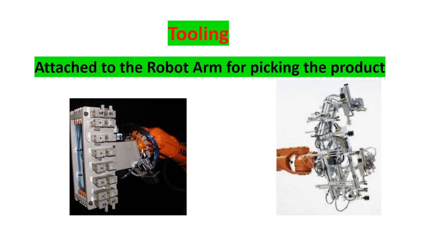Reminder: if your robot has tooling, you need to drop it in a rack or cart, because sometimes your robot is located in a tight space, and once you execute the calibration routine, you might hit the guarding or fence of the robot.